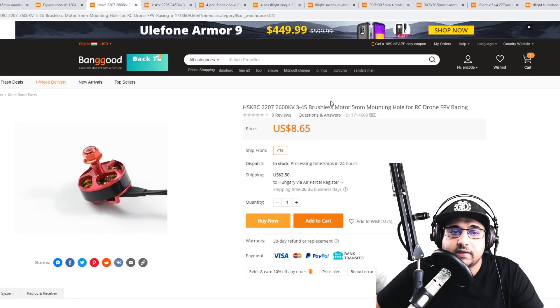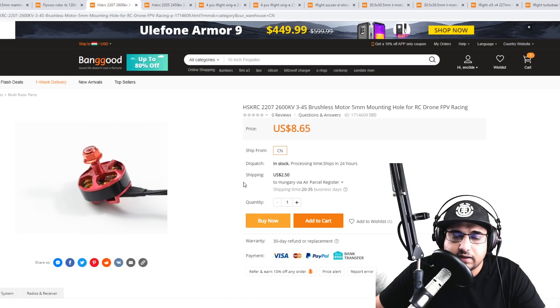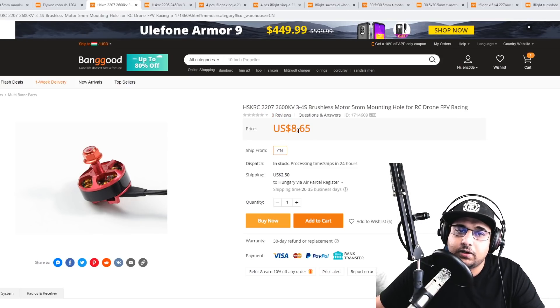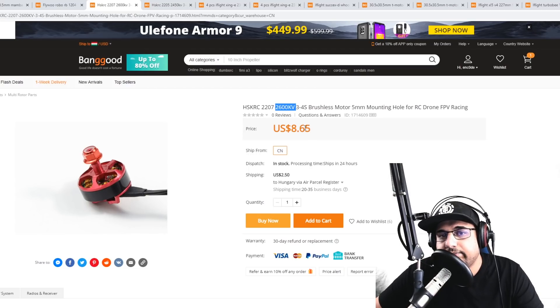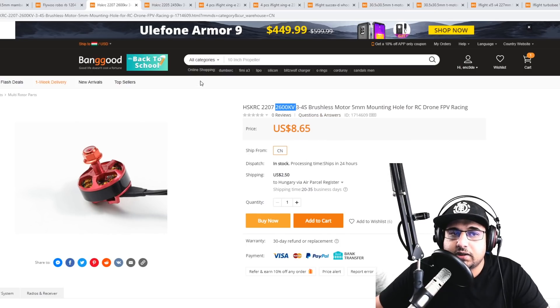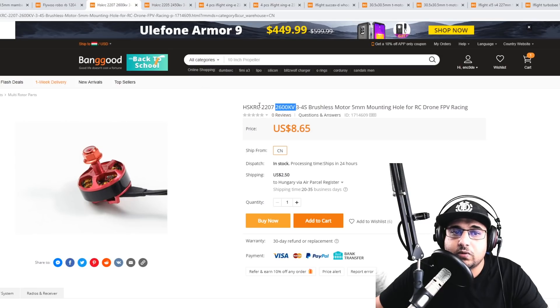Here's a mention but not a recommended one. These look like DYS motors rebranded — I think DYS may be going out of business. Usually when buying cheap motors, you want to go for the higher KV, because I've gotten cheap motors where the actual KV was 100 to 200 lower than stated. So if you want a 2400 KV, buy the 2600 and hopefully you get what you paid for. These are pretty cheap but not recommended.